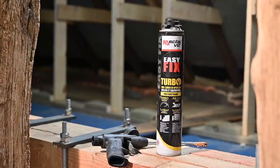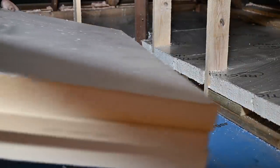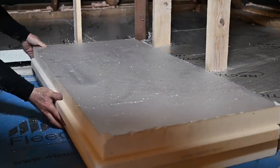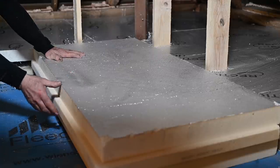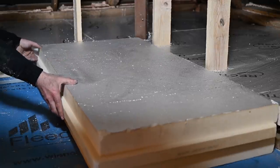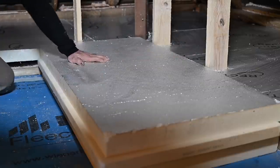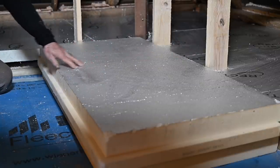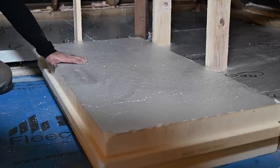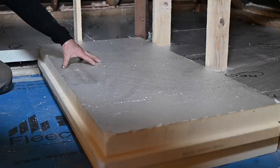Let me show you the floor panel now. The panels that go on the floor are really thick panels, insulated on both sides with aluminum — both the top and the back — and they're also tongue and groove. They will go against the sides and we'll tack those in place with a little bit of glue so they don't shift around. These panels are 16 centimeters thick, or about 7 inches, providing a very good insulation factor.